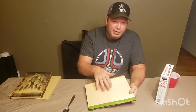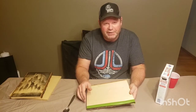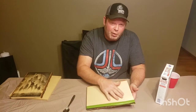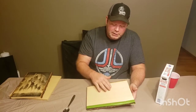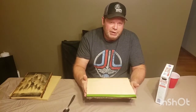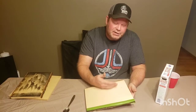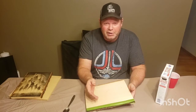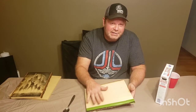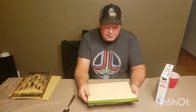After you put on your borax you can just take a blow dryer and blow dry it. It doesn't have to sit — it's not a requirement that it soaks into the wood for a long time. You're just getting the fine borax particles down inside the wood grain, so it doesn't have to sit for 24 hours and naturally dry. You can just take a blow dryer, get it dry, and you're ready to go. When you're done blow drying it, if you feel the wood it'll have kind of a gritty texture — you can feel a little borax film on there. Just take your hand and wipe it off until it's back to smooth. If you leave all that residual borax on there it's just going to burn the soot, and when you go to clear coat it all that soot will just brush off — it's not embedded enough into the wood grain. So make sure you clear off that extra borax from the surface.